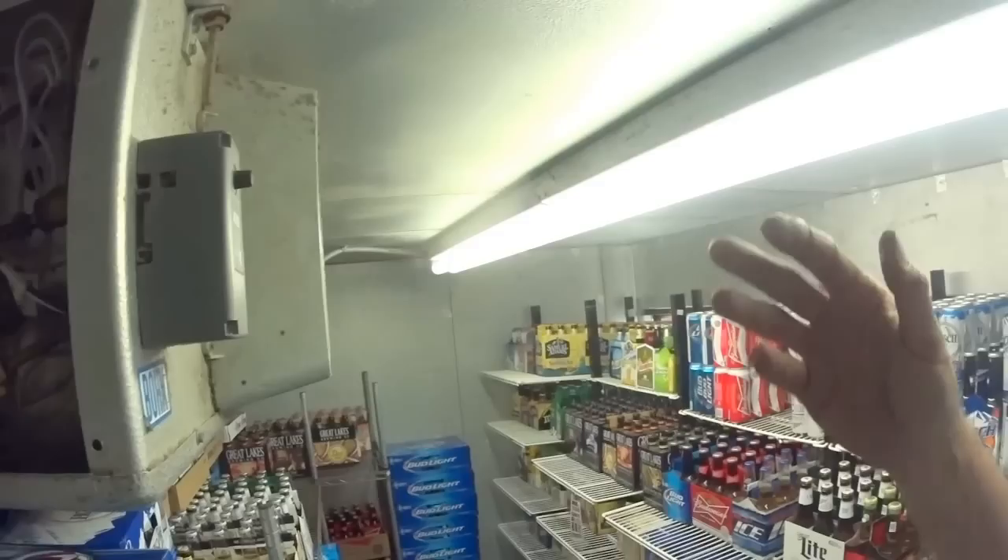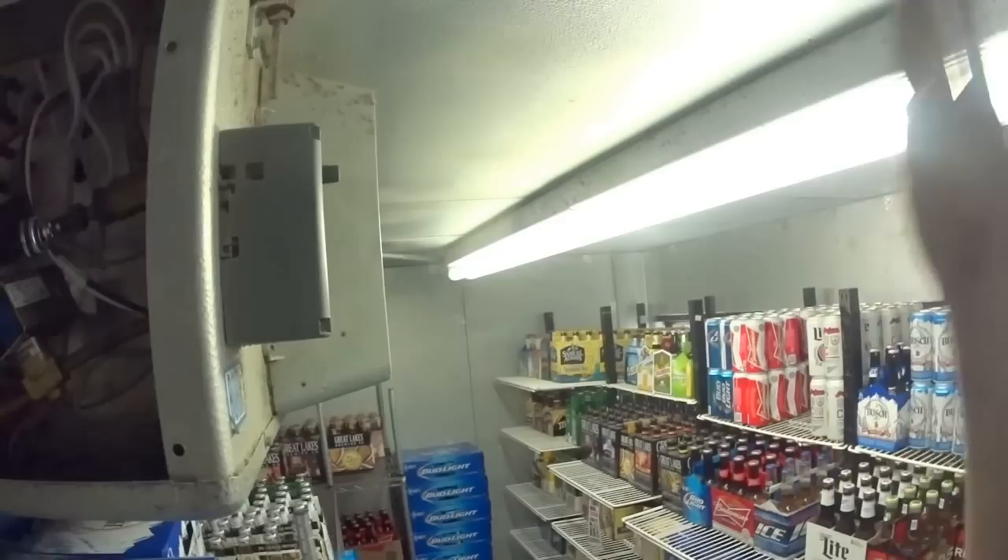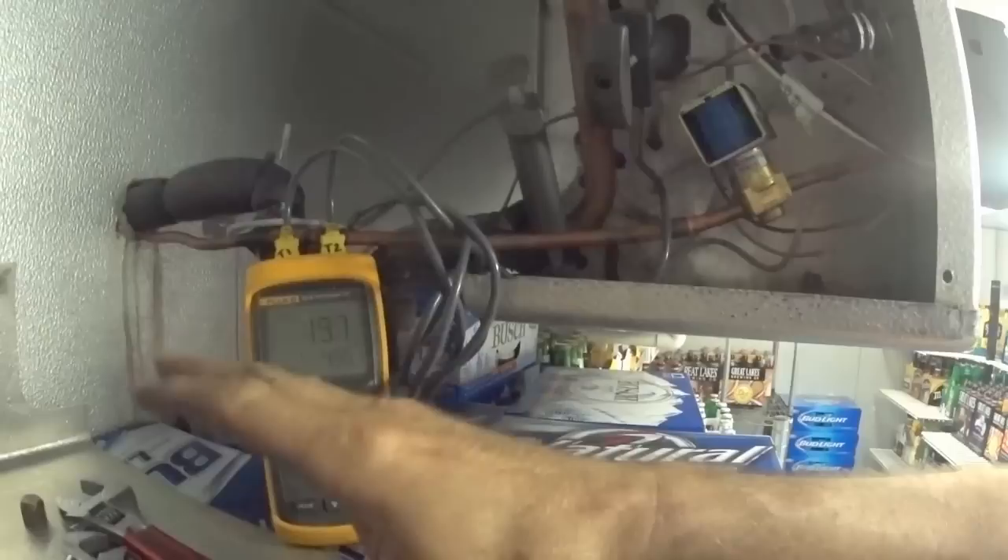If this was a pizza cooler, you'd want it cold and damp — you want to see your breath. That's very good for pizza dough, meat, or produce; you want it very damp. So you would want a 10-degree temperature difference. You'd open your valve up until you got a 10-degree TD for pizza dough, meat, and produce.